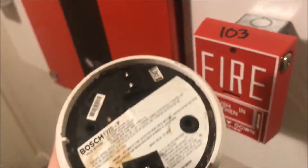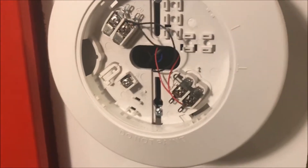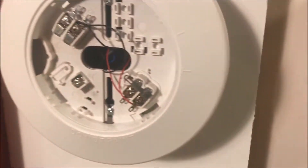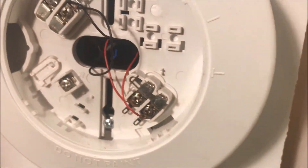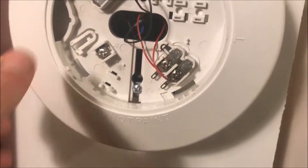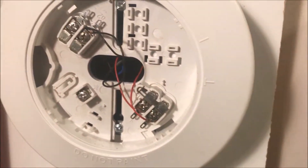This is the actual F220-P device. I'm not a fan of how this base wires up — I don't like how far away the terminals are, because when you have to put the end-of-line resistor in it doesn't reach and you have to use a little jumper. It was kind of a pain to wire up and it wasn't really labeled nicely in my opinion.